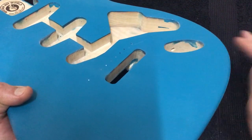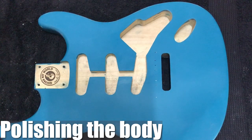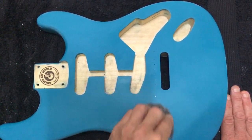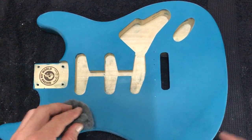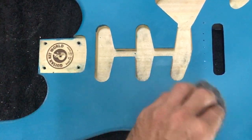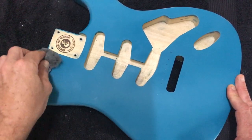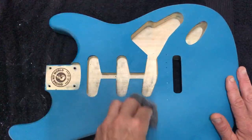Okay so the guitar has now been sanded mostly flat — there's not really any evidence of that orange peel anymore. So what I'm going to do next is apply a very fine grade steel wool — super fine grade — and just start polishing the top of the guitar using a circular motion. Now a lot of people aren't huge fans of using steel wool and that's understandable — it leaves a lot of fibers on the guitar. Especially if you're going to follow up with a buffing wheel or any machinery, you're applying heat in small areas, and if you've got any of those fibers remaining they're going to heat up and embed themselves in the paint. You need to clean the guitar up very carefully after using it, including your cavities. Also bear in mind your pickups are essentially magnets so any loose fibers are going to be drawn to those. If you like a matte finish you could pretty much leave things there.